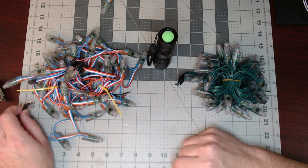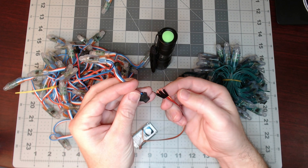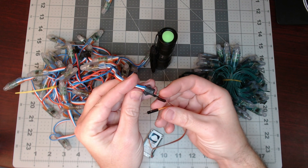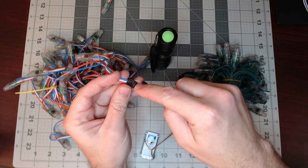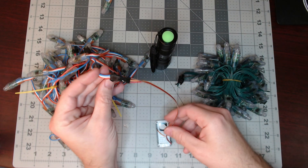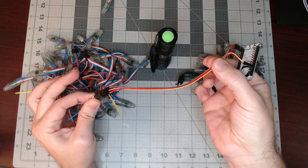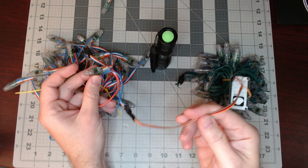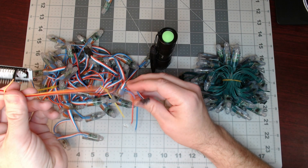How do you power your NodeMCU? It's actually this simple. Take the plug — I'm using red for my positive voltage — and plug it into the connector. The data is the middle pin, plug it in here. This is not going to be waterproof, so do take that into consideration. Then plug in your ground. You know they talk about level shifters and long runs — how long is your run now? You can get three or four inch jumper wires for a super short run, so you never have to deal with sacrificial pixels or any of that. It's this simple, even easier than before.